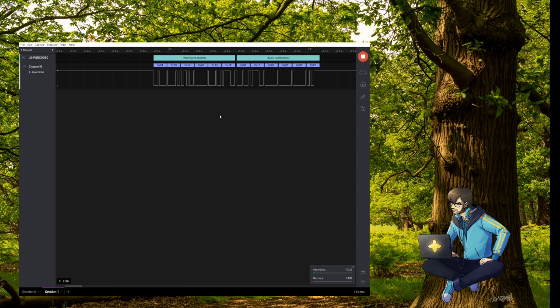I think the next thing that I need to experiment with is going to be overnight: leave the window open, have it go below that value, below 25, and see if that is still correct. I expect that 1F is 25-ish because 1F is 31 divided by 2, that will be 15.5 plus 10, because that's the minimum value that this HVAC seems to support.